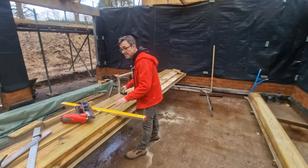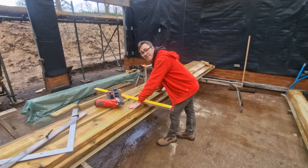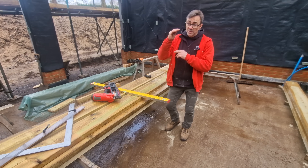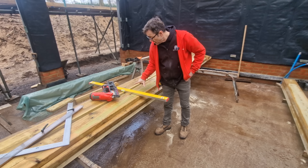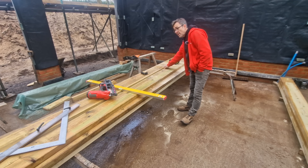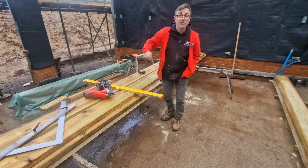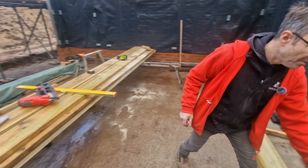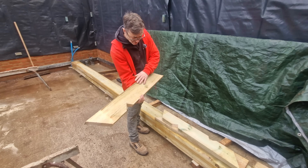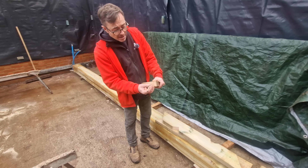We've got a lot of timber here. The rafters on this job are 150x50s, or six by twos. The hips are always bigger because you need to catch those plumb cuts, which are quite tall — we're using a hip which is 200x50, or eight by two. These long six-metre lengths are going to be cut in half and we'll get four hips out of them. Down here we've got all of our jacks ready — these will become the small rafters, and you can see the feet are done with the bevels.